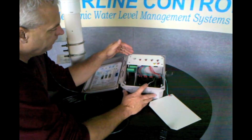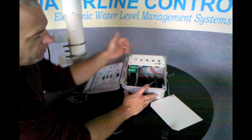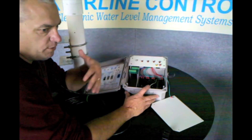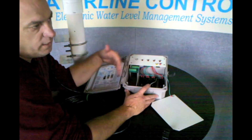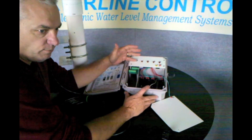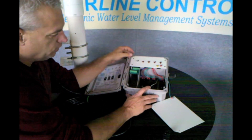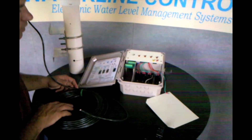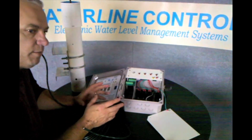There are a couple of hidden features. For example, if the probes fire out of sequence, an alarm goes off that's sent to the dry contact to notify a building automation system that there's been a false firing of one of the pins. Or, if it runs longer than expected, it has a fault that resets itself — after six hours it tells you there's a fault, the light flickers, and a signal is sent to the dry contacts. It's all in one enclosure. You mount this outside the tower, the wire comes a minimum of 50 feet, so you can mount the controller outside the tower and the sensor inside, and it's all one system.